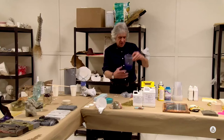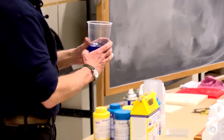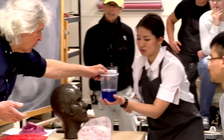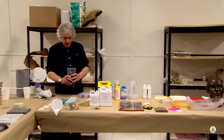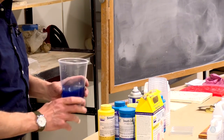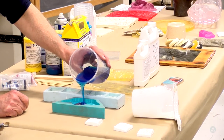You can see it's a fairly nice translucent blue - not transparent. I'm letting it warm up a little bit and if you come feel this you can feel it getting warm. When I pour it into the mold it's going to be thinner so there won't be as much mass or heat generation. Going back to the basic function of a thermoset: we're introducing heat via a catalyst or hardener to create the polymerization. Sometimes these things set so fast you can pour mid-stream and they'll stop.